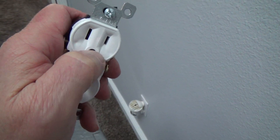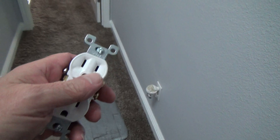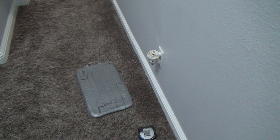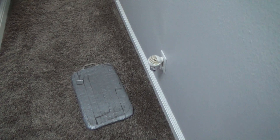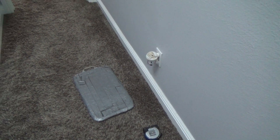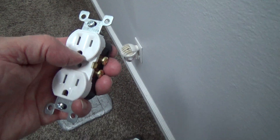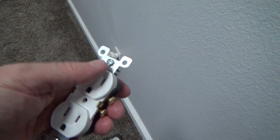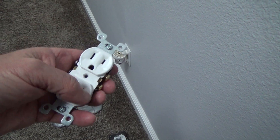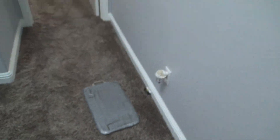If you have a broken electrical outlet — like where the ground prong slot is broken — that is a failed, defective outlet. No inspector is going to say that's still good. If an inspector comes to your house for a home sale or remodeling job and sees one of those broken, they're going to make you replace it even if it's still working. If your face plate is cracked, or one side isn't working and you always have to plug in on the other side — it's defective, go ahead and replace it. That's what this video is about.